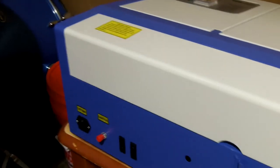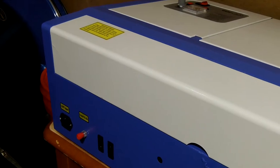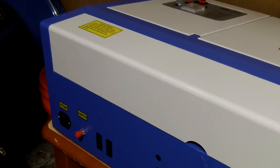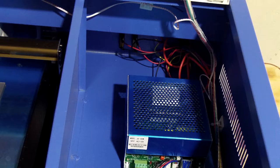And I'm gonna look down here. Let's come down. And it looks like I have some European outlets, so I guess I won't be using those. But from what I read online, you shouldn't be using those anyways. They're not properly grounded anyway, so if you plug something into them, you're not gonna get any grounding. So I'll keep going. I'll take this thing off, see how the connection to the chassis or the case is, and give that some sanding love to get some electrical connection with the chassis, so if anything short circuits or electrifies the case, the grounding works properly.